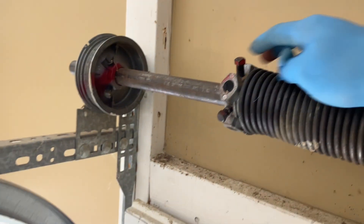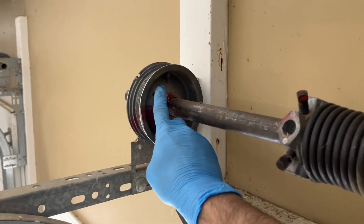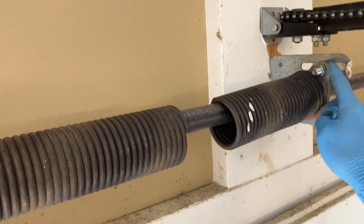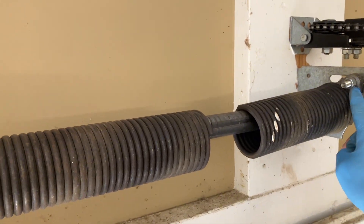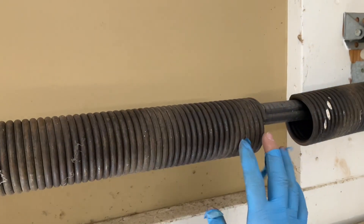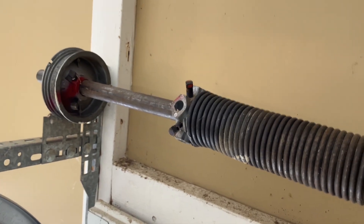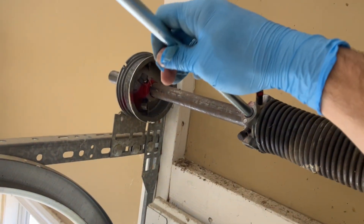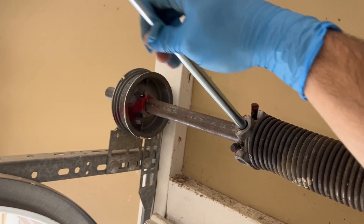The first thing I'm doing is loosening up these bolts here, and also the two on the other end and the ones on the center mounting bracket. These down here were 9/16 — the paperwork was wrong, which doesn't surprise me, but no big deal. When you're loosening this, my spring was already broken so the tension was gone. But if your spring isn't broken, you'll want to use the winding bars to hold the tension while you loosen those bolts, then slowly let the tension out of the spring.